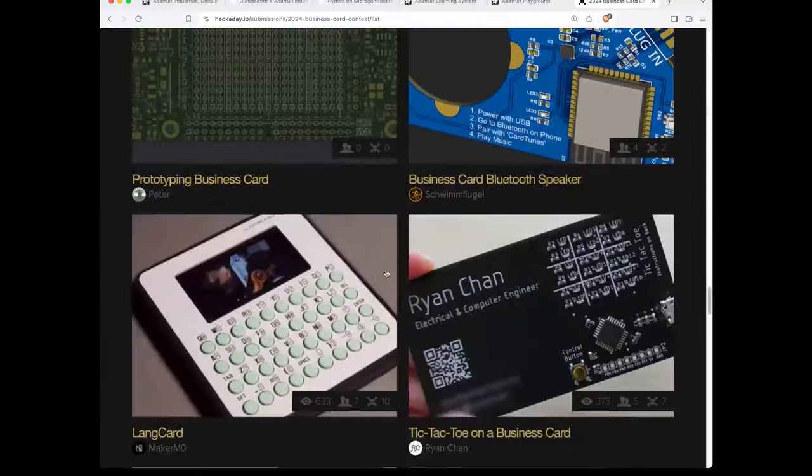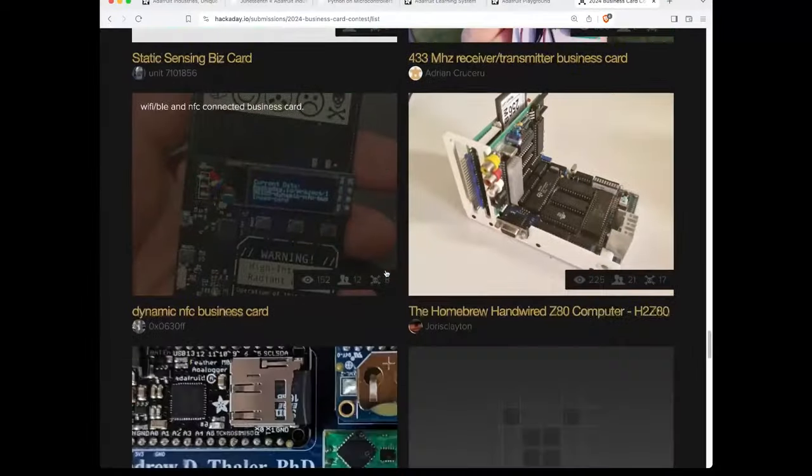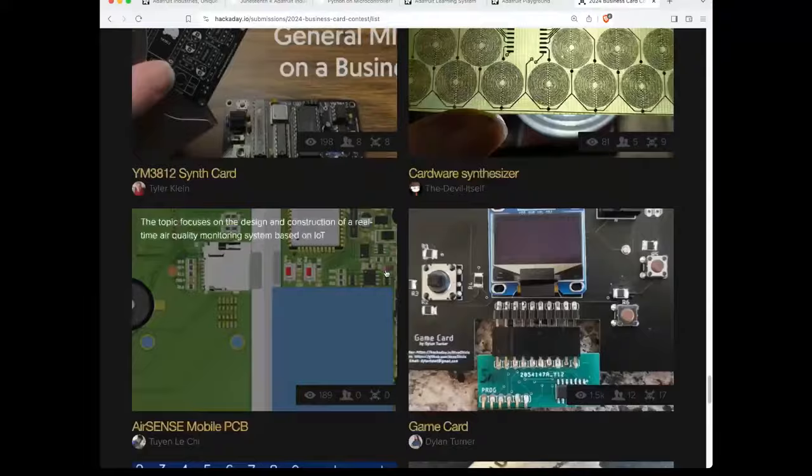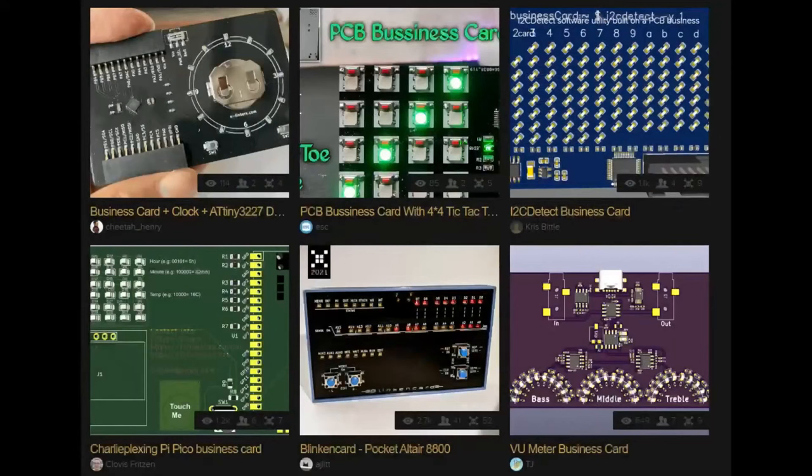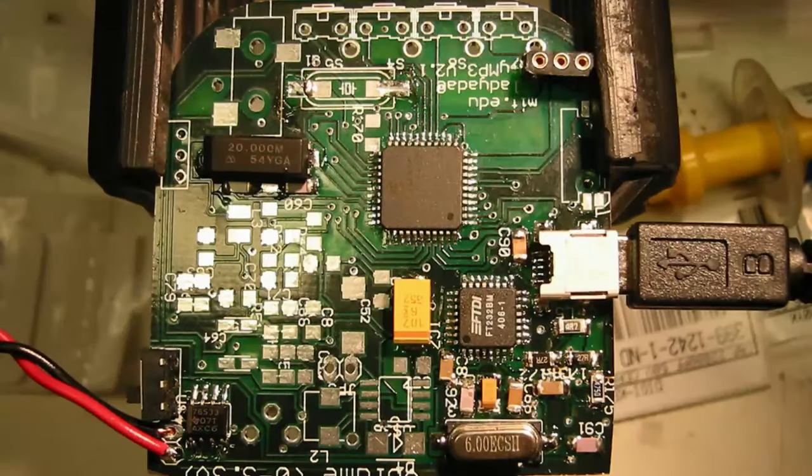There are a few through-hole, but a lot of people these days are doing hand assembly of SMT, which you kind of have to do because most components come in SMT. So this is why a good tweezer set is important — when you get the low cost tweezers in your soldering pack, they're probably fine for something like a 1206.